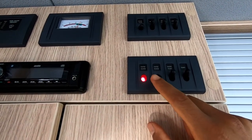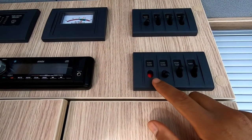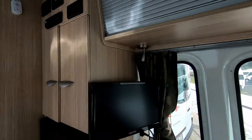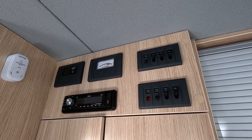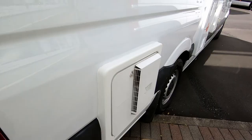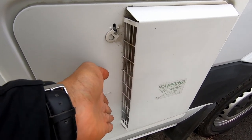That click indicates a fault. This system will keep trying to light — it'll attempt about three to four times, and if it's unsuccessful in all those scenarios it'll default to just a red light. When that red light is off, that means the ignition on the gas boiler is on. Another way to check is to go outside and test for hot air. Here's your hot water heater — if you listen closely you can hear it running.